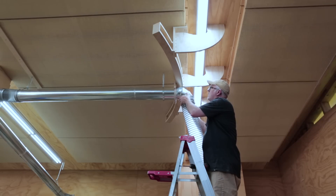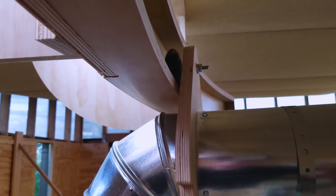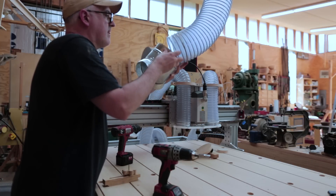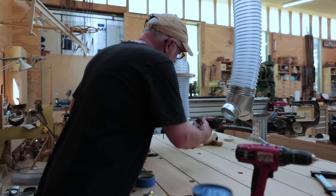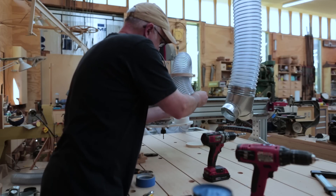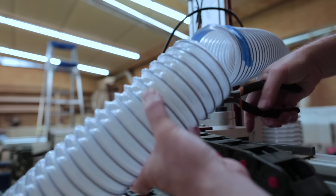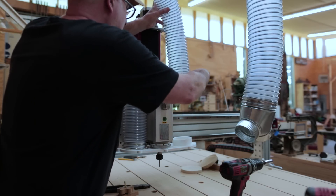Now I can add the little support that goes between the pipe and the track. I put it together and it kind of worked — you can see it working here. But I'd always had in the back of my mind that the wheel in my little groove in the beam just wasn't safe enough; the wheel could possibly come out and the whole thing would fall. Someone also mentioned that having the six-inch hose come down with much shorter four-inch hoses would be a lot better for airflow — and thinking about it, I think that's true. There's almost the same volume in two four-inch hoses but a lot more surface area, and it's really bumpy surface area with flexible hoses.